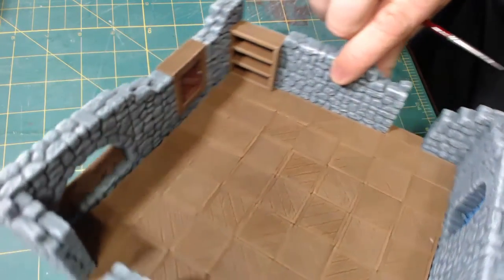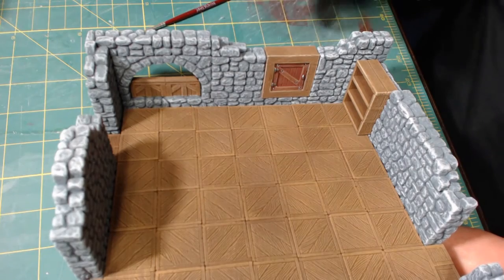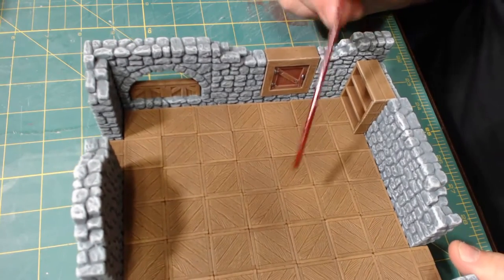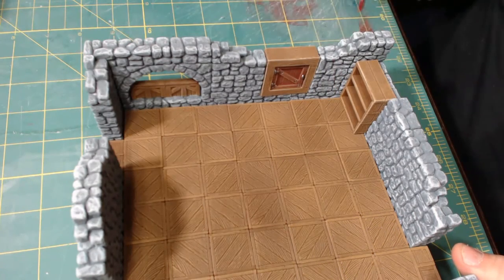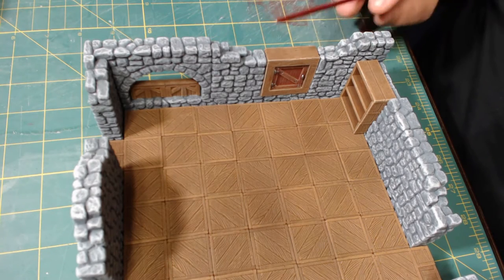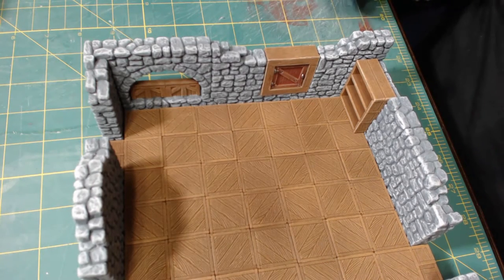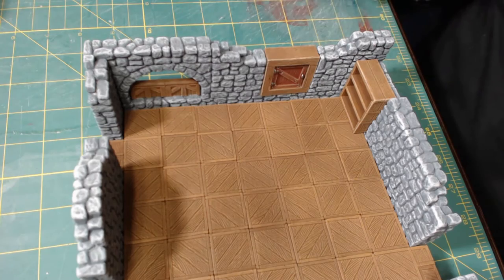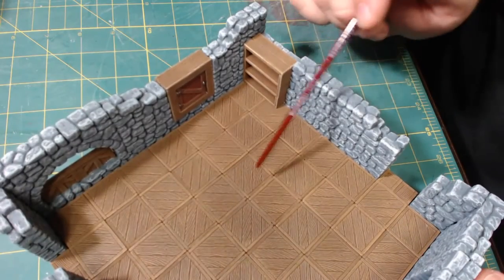The project is rolling right along. Sorting the blocks helps because in here you had to pull out 49 blocks. I do a diamond pattern — the wood grain is coming into one point on all four blocks, which keeps a consistent pattern across the floor. You don't want blocks going every which way because it might pull your eye in different directions. Having floor tiles in the same pattern will keep your eye looking at the whole piece versus focusing in on some anomaly in the floor.